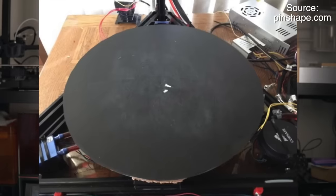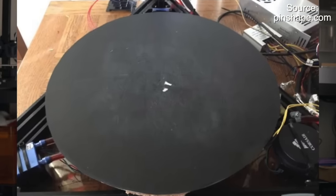There is another way I've seen rafts used recently, which to me is more of a patch or a bandaid. Let's say you have a build surface and it got really jacked up — like you have some kind of adhesion sheet, whether it's BuildTak or some other adhesion sheet, and your part almost bonded with it and tore off a little chunk, so you have a divot that's causing issues. I could see a raft as being something you'd want to lay down to cover those imperfections in your bed and at least give you consistency on top of the raft. But again, that's more of a bandaid and not something I use. If I have an issue with a bed adhesive, I usually swap it out for glass or powder-coated PEI or something of that nature. It's at least a use case that might be handy for some people if you just damaged your bed surface and don't have a spare one on hand.